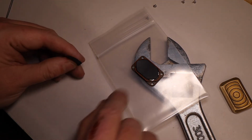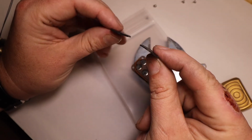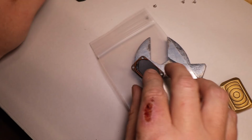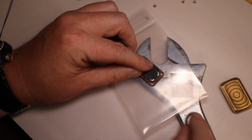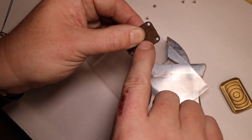With the micarta plates, I recommend using this 1/32 inch thick foam plate, and then there is a 1/16 inch, so they are thicker, thinner, relatively, right? So the 32nd, which is the thinner, goes with the micarta plate. That'll keep it from having too much compression and bowing out the center of the plate on this side.